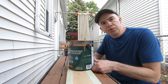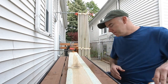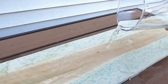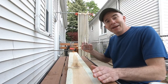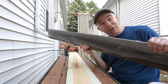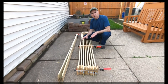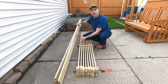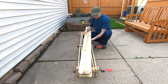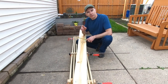It's been three days since I clamped all the boards together. I want the wood to be as dry as possible because I'm going to apply this waterproofing stain and sealer and I want it to soak in so it lasts as long as possible. To know when it's ready, take a glass of water and pour it on the wood — if it beads up and doesn't soak in at all, it's not ready. Let it dry; don't be in a hurry. It might take a week, even two weeks depending on the weather. It's been about a week now — here are two boards I didn't clamp, and you can see they warped quite a bit. The boards also shrunk about an eighth of an inch in width, so it's best to wait as long as possible.